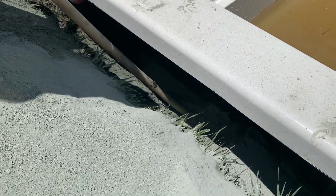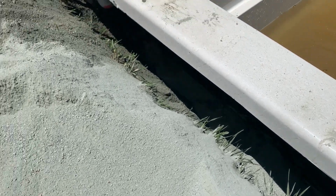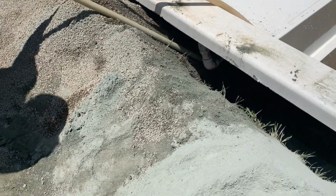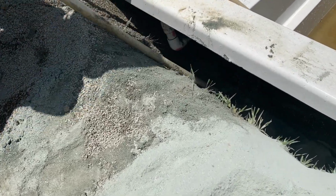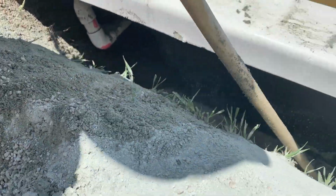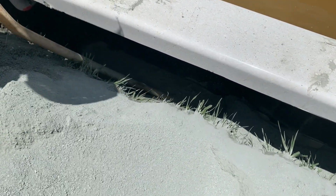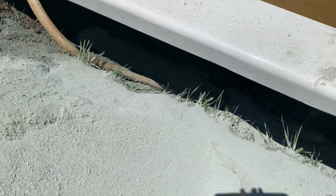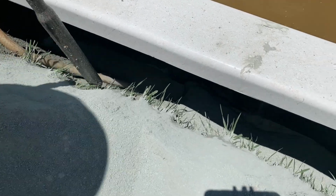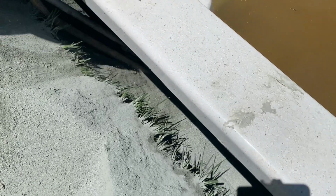And a most important part, and a couple of key takeaways, is after that first 300 mm of water's in the pool, that's where you take your time to get the pool level. After that, the level of the pool shouldn't change, and make sure that you're keeping an eye on the walls of your pool so you're not bowing them out because you're pushing too much backfill around them, or the pool walls bowing in a little bit because the weight of the water is pushing the pool wall in towards where the backfill is, and you haven't quite got enough backfill. So you just get a little bit more backfill down into that part to get the walls straight.